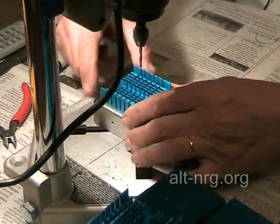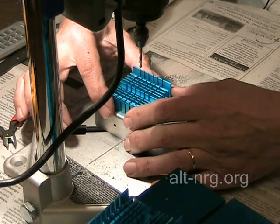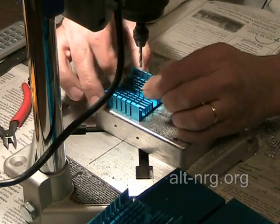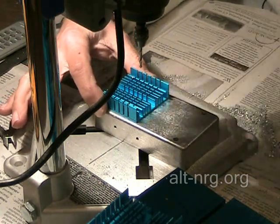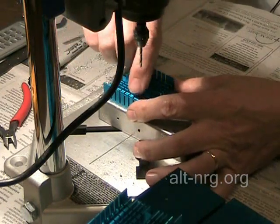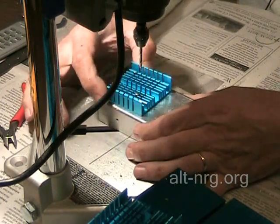I drill my first hole, and when I go to drill additional holes I don't want the heat sink to wander across the top of the box, otherwise the holes will not line up. So I drill my first hole and then take a 4-40 screw and send it down through — that holds the heat sink in place and keeps it from wandering. I can then drill additional holes without worrying about misalignment. Now that hole is drilled, I send the 4-40 screw down through the top of the heat sink and into the hole. The heat sink is now locked in place — it can spin but it can't wander.